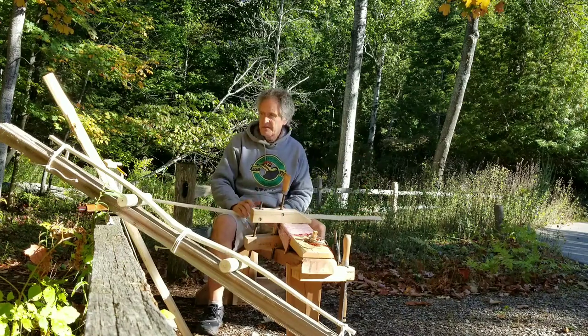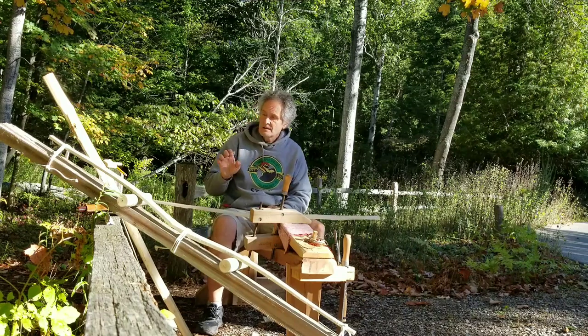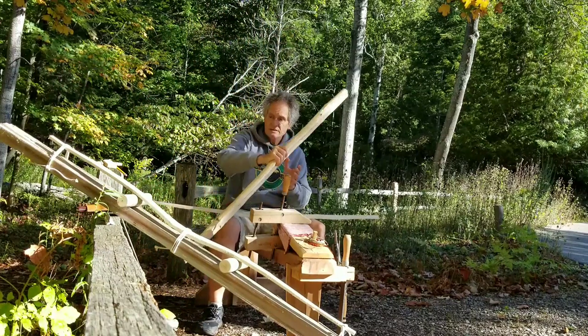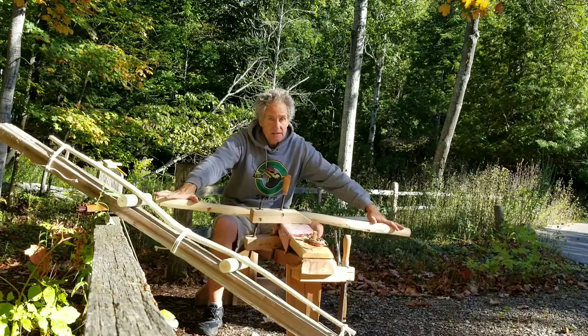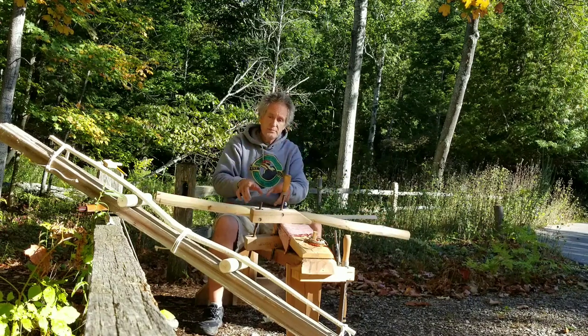So out of this modest video, I hope you take away that soaking these is not curing the wood, it's just putting it in cold storage and allowing them to stay green longer and eliminate the cracks. Suppose you didn't want to soak them, you wanted them to start drying. If you have a full round, do take the bark off.